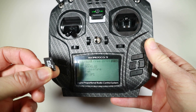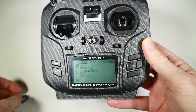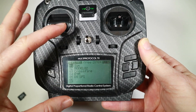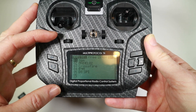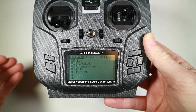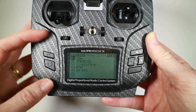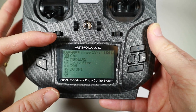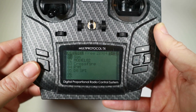Mostly, the bulk of the storage on the SD card — and you don't need a big one, this is only a 2 gig card — is the sounds. You'll notice when I turned it on it didn't say anything. The other things you'll have in there are things like the Lua scripts that we run to configure things like Crossfire. And if you've got any firmware you want to update, that would be stored on the card. So I want to take you through a couple of the initial settings you should do, and then what you'd actually do with the card to get it set up ready for your radio.